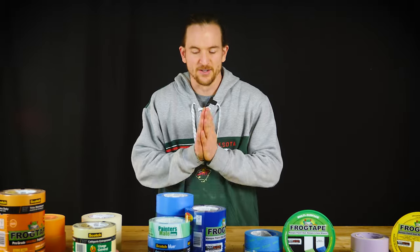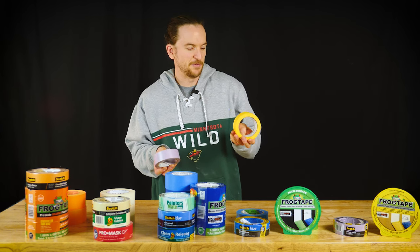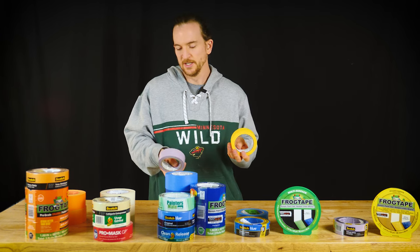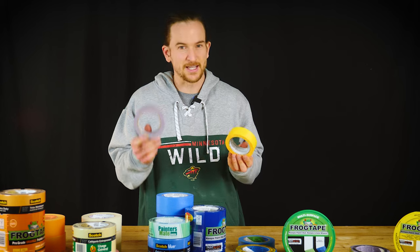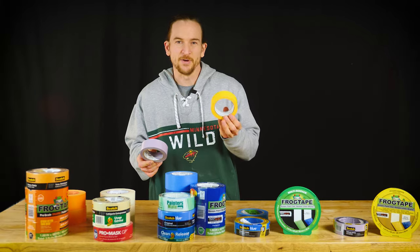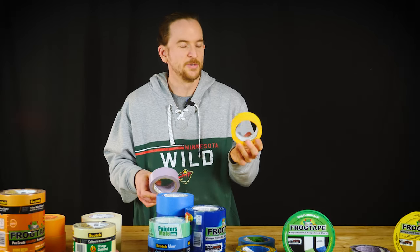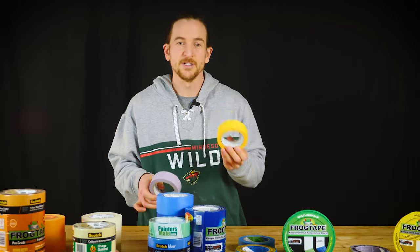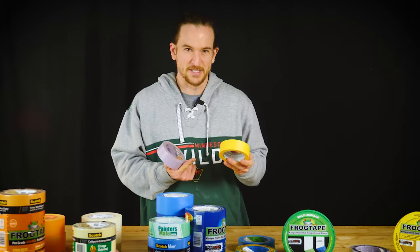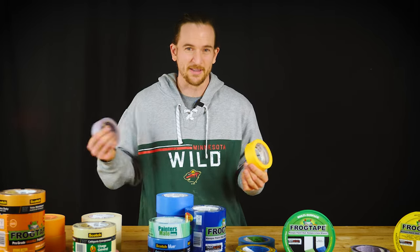Before we get to conclusions, nobody sponsored this video — none of these companies have anything to do with it. For delicate surface tape, FrogTape outperformed 3M slightly on the hardwood floor, left no residue at 28 days, and drastically outperformed Scotch on the line test — and it's a dollar cheaper. FrogTape is the clear winner. As for when you'd use delicate surface tape, I'd really only use it when taping off floors. Our test proved absolutely that if you're taping hardwood floors, you need delicate surface tape — otherwise you'll spend hours removing residue or you might peel that top layer of finish off.